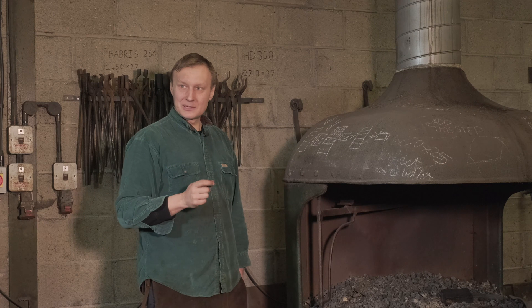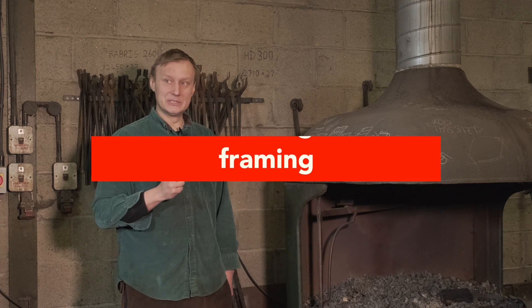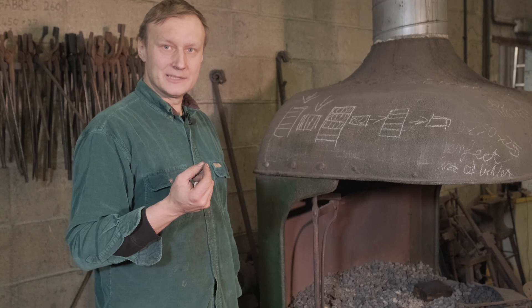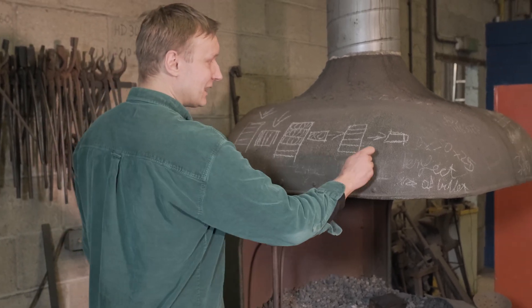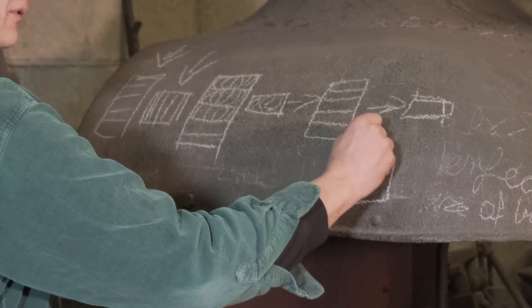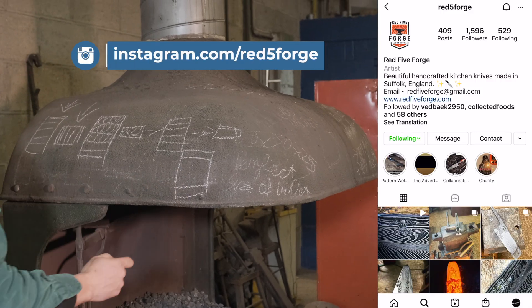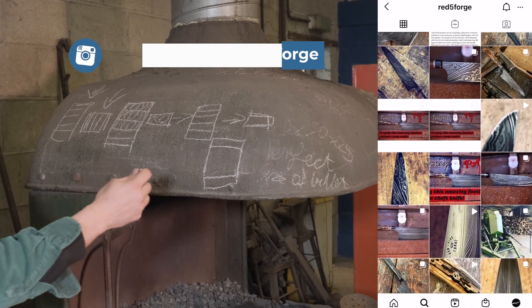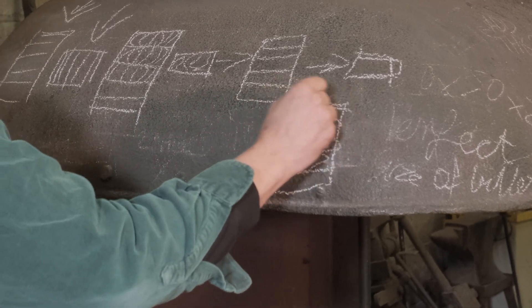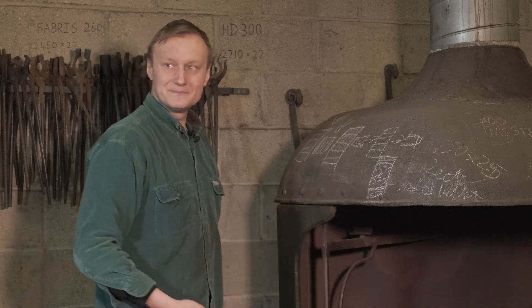After all the restacking, I'm going to do something called framing. Because the stack has a bit of nickel in it, and you don't really want soft pure nickel near the edge of your blade. So when we've got our final stack, we're going to put layers of high carbon steel on the top and bottom. This is a technique I picked up from Red 5 Forge — check him out as well. This will give us the crazy pattern while having a nice high carbon steel on the sides for the cutting edge.